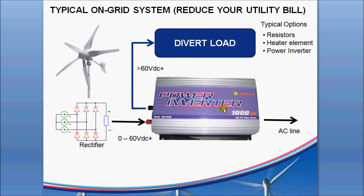This new Sun-G class of grid tie inverters does have a divert load output. The one I have here is the 22 to 60 volt version. At 60 volts, two MOSFETs inside will start to switch on and divert all of the power coming in on the input side right to the output port. All the power that comes in will actually go out at that point until the voltage drops back down below 60 volts again. So the question is, what kind of divert load sizing do we need on that kind of system?